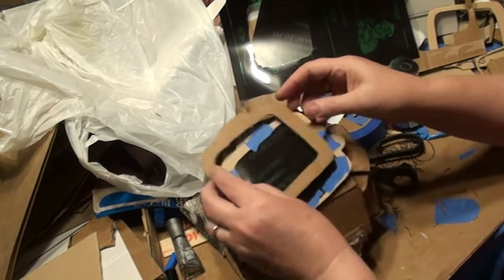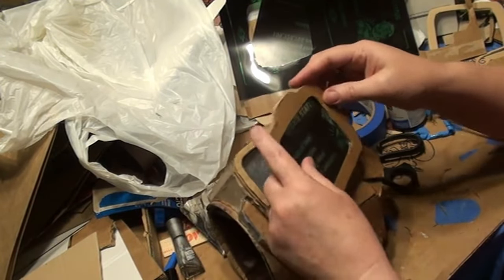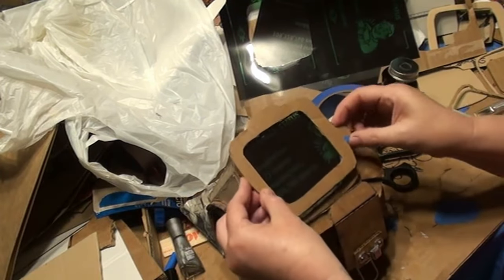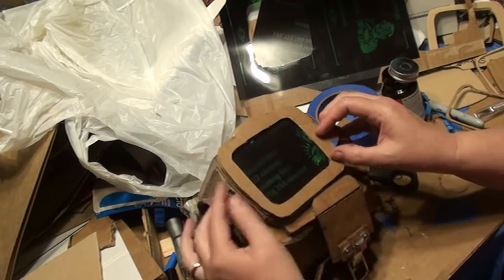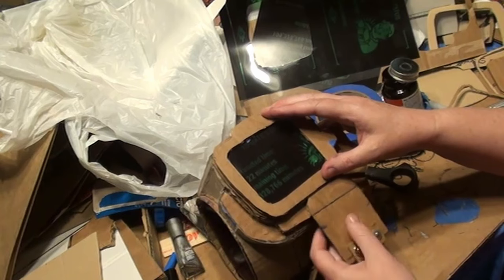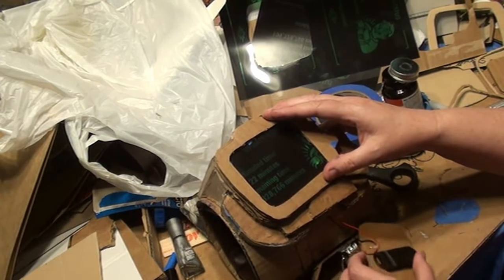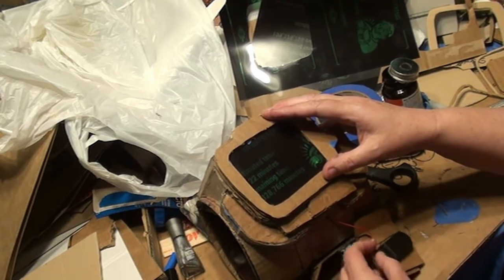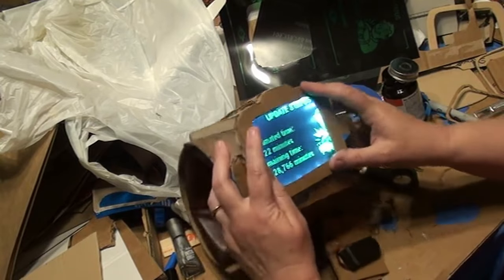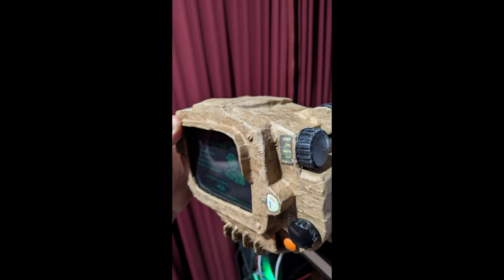Having some room for error is exactly why I had more than one image on my transparency. Now take your screen sandwich and put it on the housing on top of layer four — your housing is layers one, two, three, four, five. Put it on top of your layer four over the screen cavity with your lights and test the fit and size, see if it needs trimming to be nice and smooth around the edges. Make sure you like it, and make sure the lights are still vertical and not squished. If they are, add more layer fours. Wipe that wet alcohol off immediately with a new wipe and make it as streak-free as you can, especially the back side — you won't be able to clean it once it's glued in. Then rubber cement that screen in place.